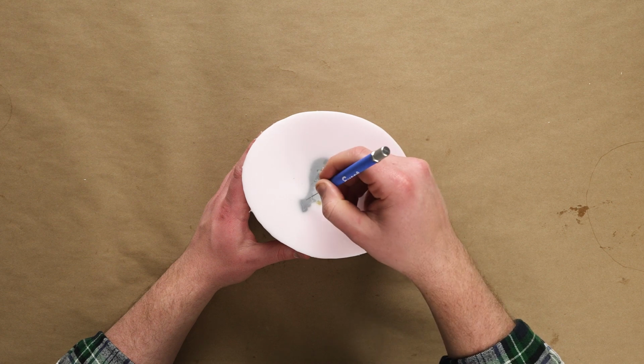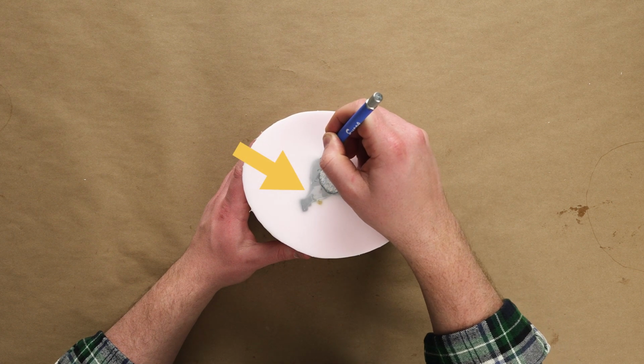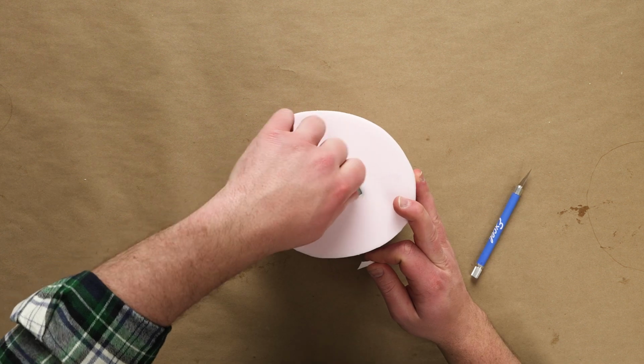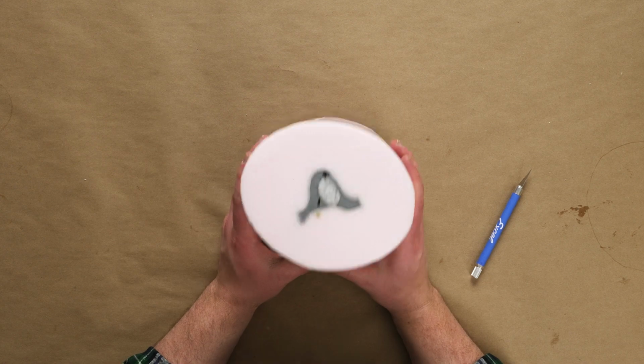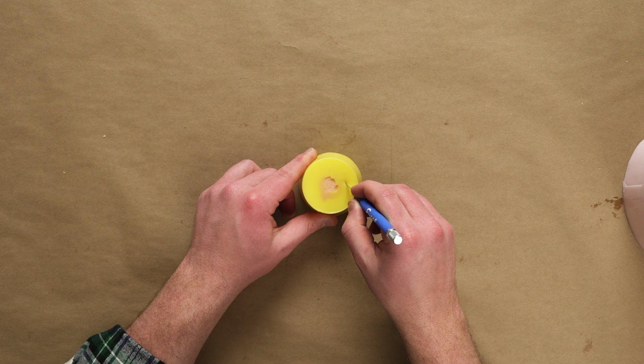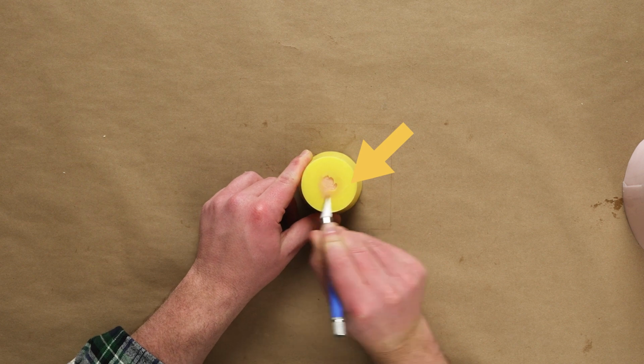When going to cut the silicone, it's important that we start slightly away from the edge. Trimming the majority of the silicone will give us a better view when we go back and more closely trim the edges of our silicone. If we start at our edge, we may accidentally cut further into the mold and damage it.